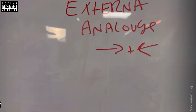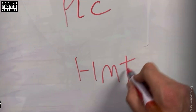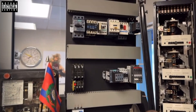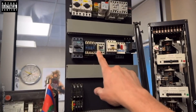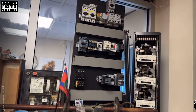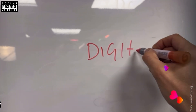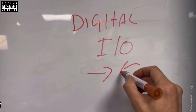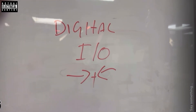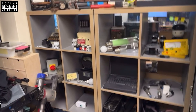I've got a few milliamp instruments but I want to incorporate them, so I'm going to need to provide terminals on the test rig - external analog ins and outs. I want my PLC on it, my HMI on it. I have a fine array of shitty contacts and relays. Do I want them on my test rig? Maybe I'll just operate little relays and contacts that are external. Maybe I'll provide terminals for that. I want external digital inputs and outputs for operating stuff. That about covers that shelf.